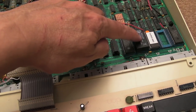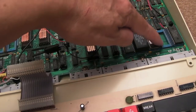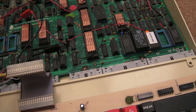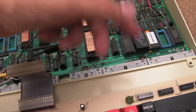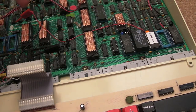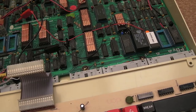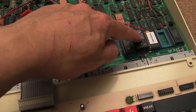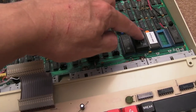The nice thing with this is because it's got the battery in there, I could use the sideways utilities. Once I get the 64K EEPROM in here with the DFS — the disk filing system — I can use the sideways loading software to fill the two RAM slots here with other ROMs, and after I switch it off and on, they should still be there. I might need a mod to protect the write enable, because at the moment you could write to this and it'll get overwritten. In theory I could have an external switch to disable the write enable and make this effectively a ROM, with the data held by the battery.